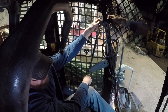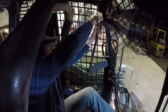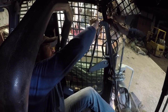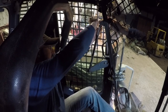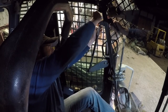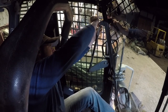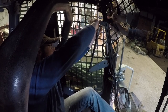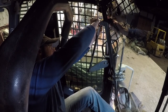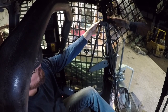I flipped them over the other way where the cylinder part was up here, and they wore out even faster. Talking to the mechanic at the dealership, he was thinking that the dust and junk was blowing in on there, sitting right where the cylinder was going back inside, and pitting them out and wearing the seal. I didn't get all the oil and crap all over me, but it seemed like they just weren't lasting near as long. These things only last a couple months.